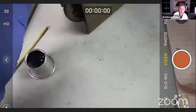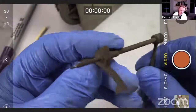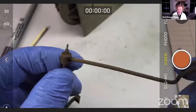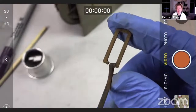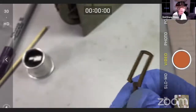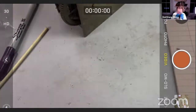I think we looked at these before, didn't we? They're a really kind of lovely shape. Nice shape with this sort of geometric top on them. Pivots look fine. They're a little bit rusty, but I'm not going to worry about that. But what's happened here, you can see, is that the crutch loop is broken. I guess the movement's been out of the case and it's got dropped or something. I'll just see if it's been repaired. They've often been repaired sometimes with soft solder and you have to sleeve them with a bit of brass or hard solder.